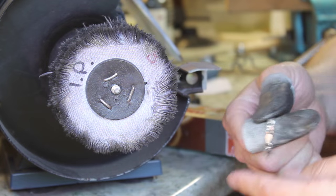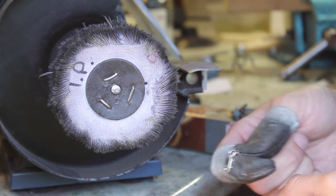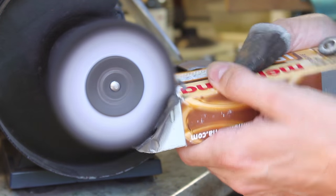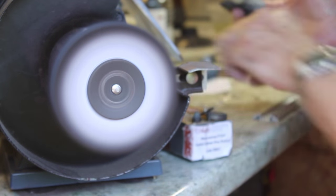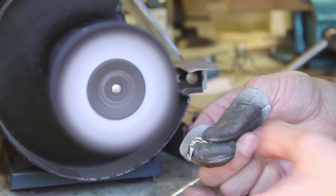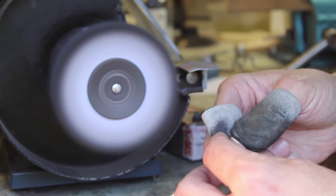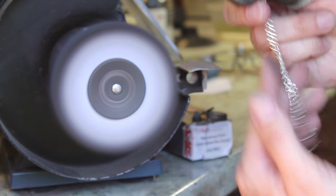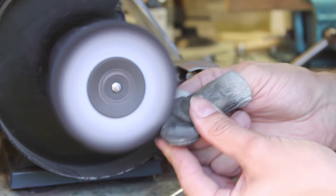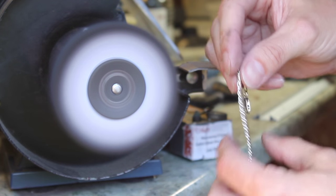If I've got lobster clasps, something I like to do is just finish them off on the buffing wheel - you just can't beat it, you get a great finish. I'm going to pop a bit of Menzerna polish on the buffing wheel here. I've got some little suede finger protectors and I'm going to buff up the lobster catch on the end. Now I know a lot of jewelers say don't polish a chain on a bench polisher because it's dangerous - normally I wouldn't, but I'm only doing the ends. Trust me, everybody's done it and everybody's hurt their hands doing it, so don't polish a full chain on it because it's dangerous.